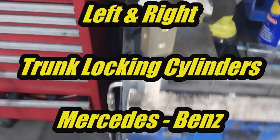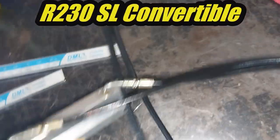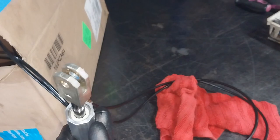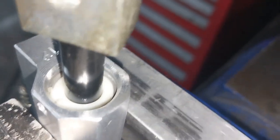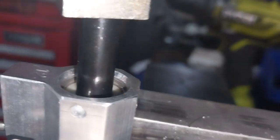So this is a couple of cylinders — this is Ben's convertible. This is quite an easy cylinder to pull apart and reseal. The tricky part is inside there — you can see that circlip. The only way to get that out easily is to measure down to see how deep it is from the top edge here, and then drill a little hole in the side, obviously making sure that that clip is not in the way.